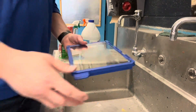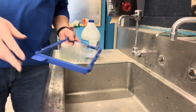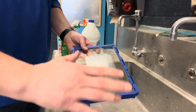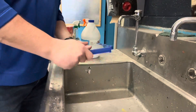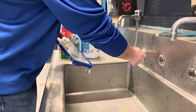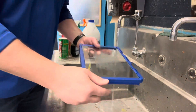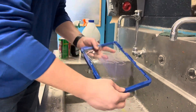We're at our sink over in the wood shop. Bring your build plate over here — please be careful transporting them, they are glass and could break very easily. You just need a little bit of water, we don't even need soap. Turn the water on — you can still see the film right there. We just get it wet and it turns purple.